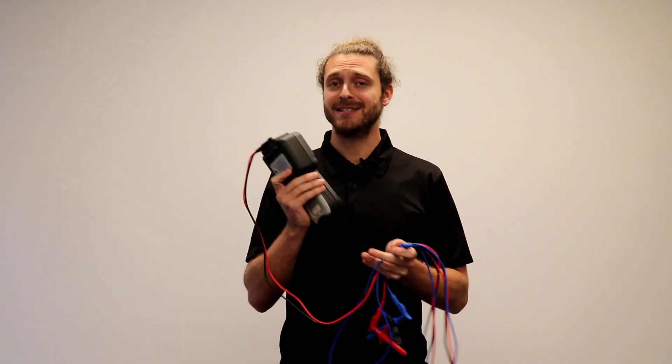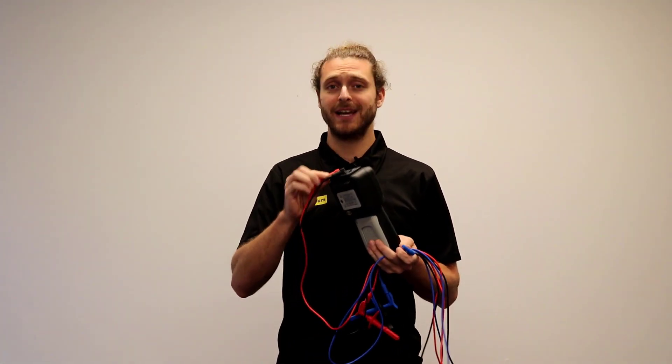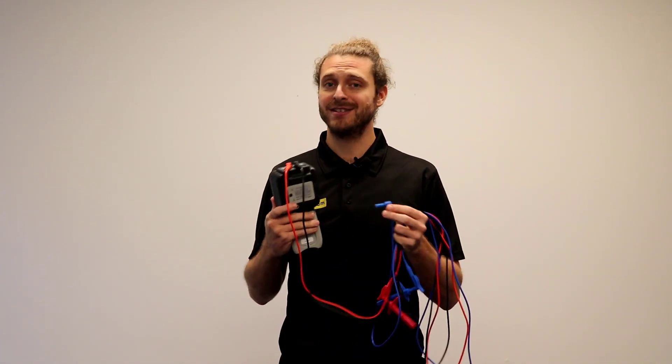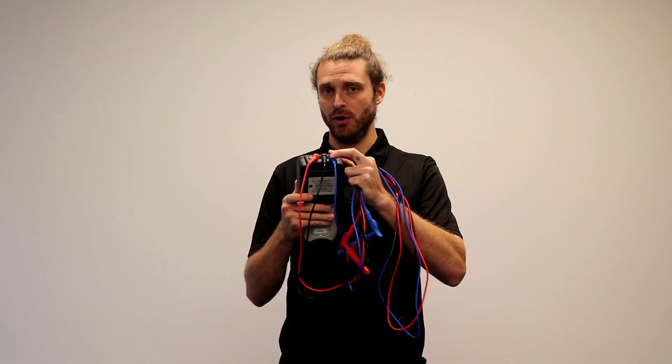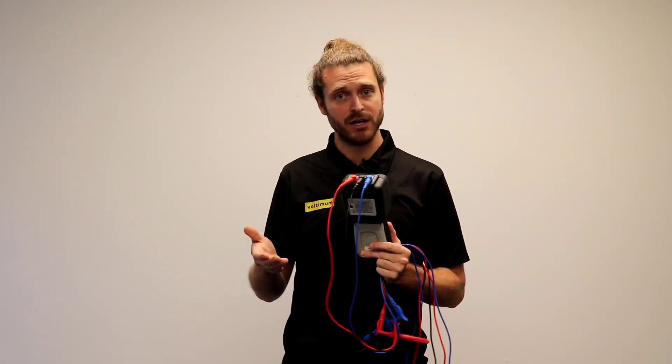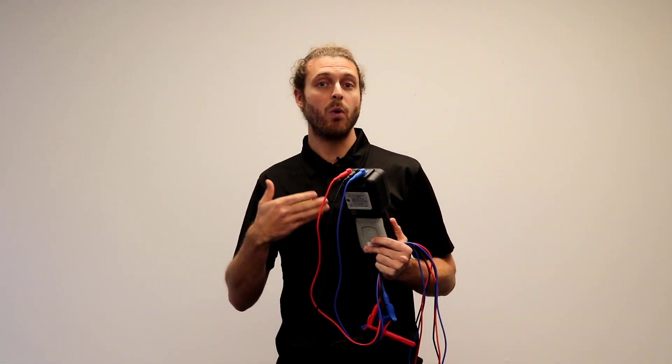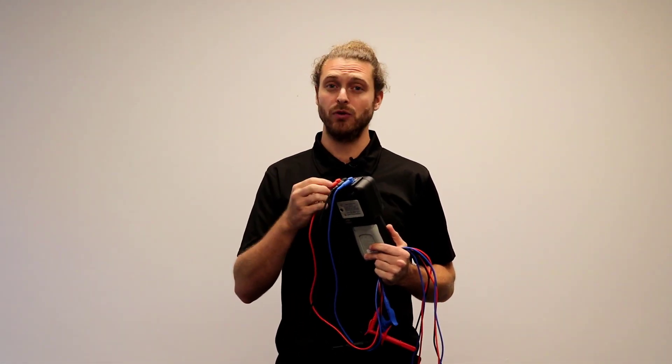The guard terminal is a fantastic feature. When you do your insulation resistance testing you use your two leads, but if you get a low resistance reading you use your guard terminal — this determines whether it's contamination as opposed to an actual low reading. The benefit is it determines whether the machine requires a clean as opposed to repair, which is a fantastic cost saving for the client and also reflects well on you in terms of engineering.